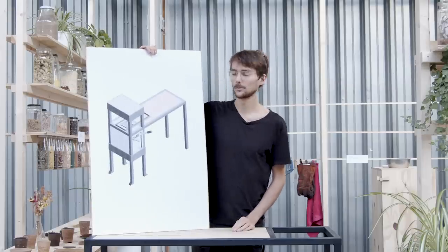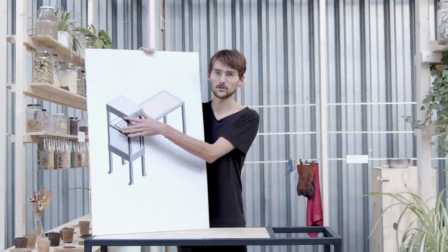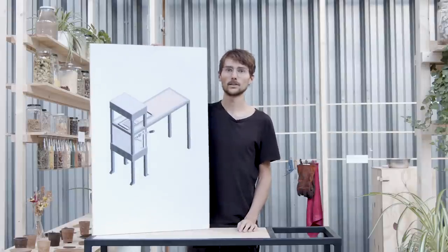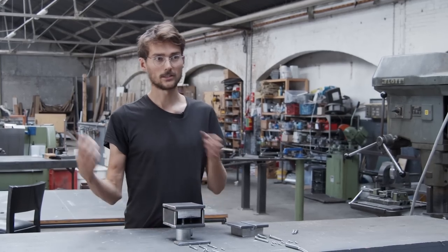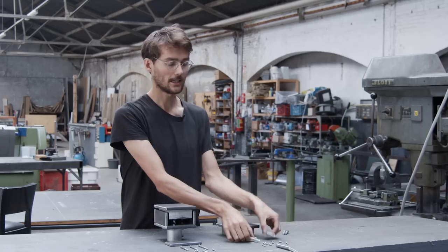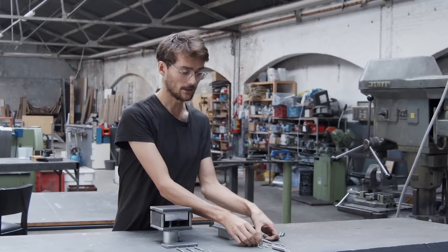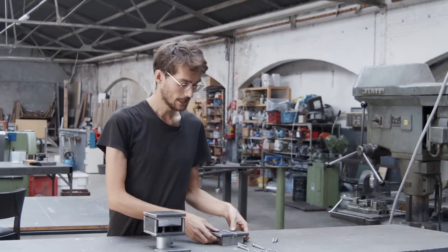Cool. So now we will make the heating elements. There's one in the bottom, one in the top. They make sure to heat both parts of the mold. I'll show you right now how to do this. We have a heating element for the bottom that is connected with the pipe connector to our jack. And we have a heating element for the top that is connected with these two bolts to the frame at the top. That's why we drilled the two holes into the square tube.